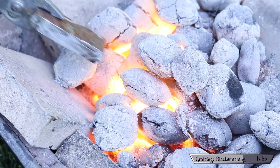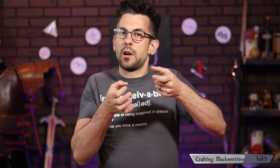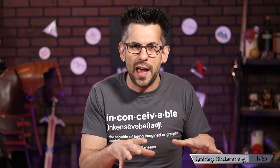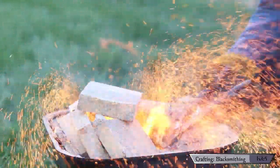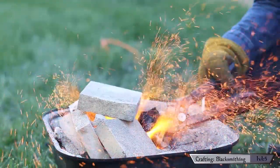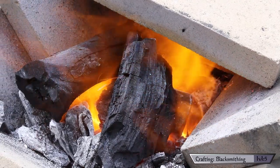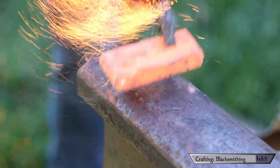With a small chunk of steel in hand and a crackling forge, I got started. Quick note: I was using those little charcoal briquettes you use for a grill, and I just want to say it is the worst source of forge fuel you could possibly use. It burns away super fast, the burning chaff gets everywhere and keeps burning — it was falling into my gloves. I ended up getting lump charcoal instead and the difference was night and day. Seriously, stay away from the briquettes.